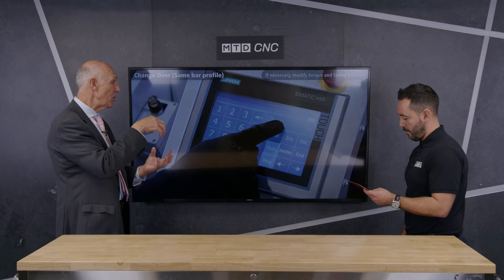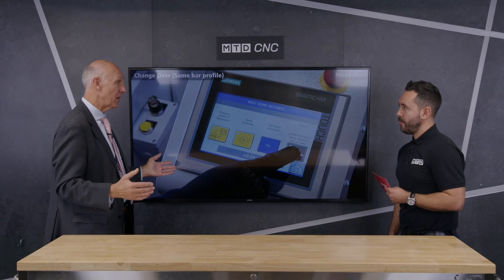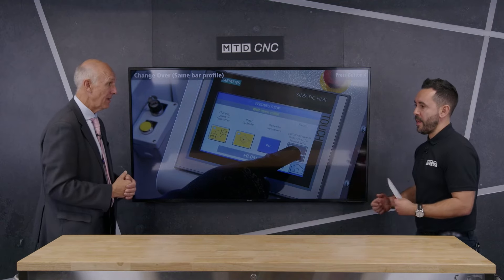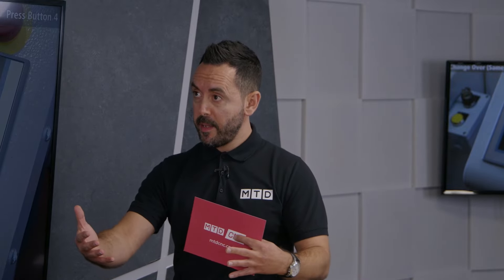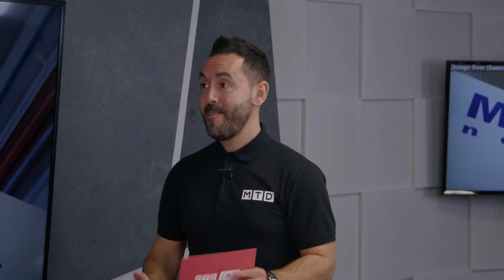The development and experience IEMCA has from the 1960s comes through in these new bar feeders. They understand at exactly what point to clamp the bar to stop any vibration — the whole purpose of a bar feeder is to eliminate vibration, and to feed the machine. Does it also save setup time? Massively — it's down to one minute on an 80mm bar feeder. So you could be feeding a 100mm capacity fixed head lathe or mill-turn and essentially eliminating setup time, running 24/7 unmanned.